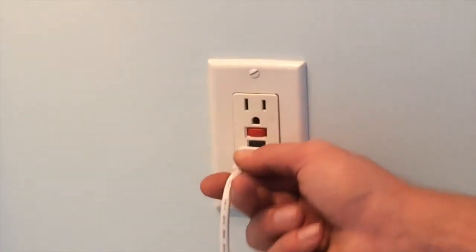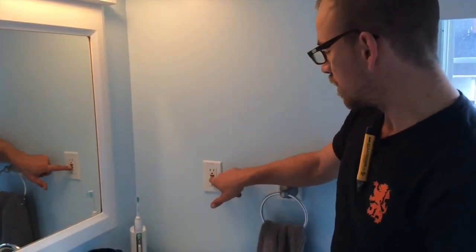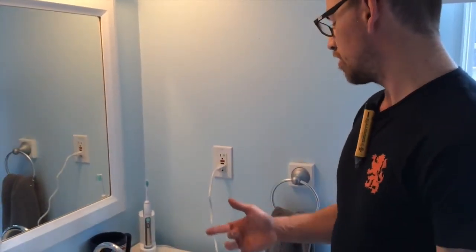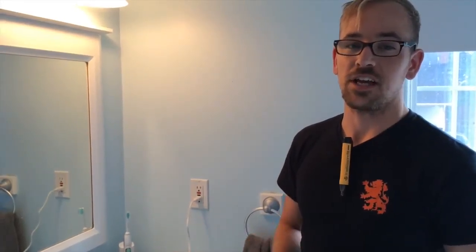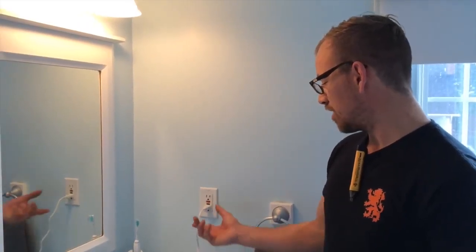That's a short overview of how the GFI works, how to reset it, and how to save some money by doing it yourself. When it trips, always test it — that puts in a 5mA resistance and makes the plug think there's a GFI trip. Reset it back in and every plug comes back on. If you have any comments or questions, go to www.delectric.ca or give us a call if you're in the Ottawa area. Hopefully that helped — if you have a tripped GFI, look up this video and it should help you out.